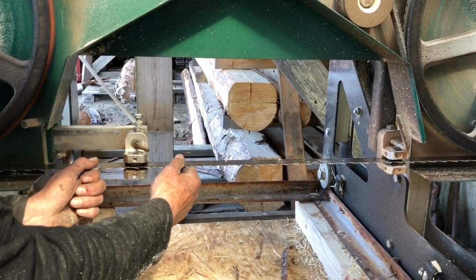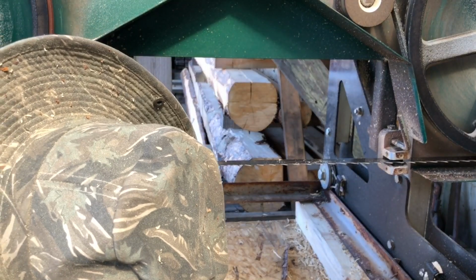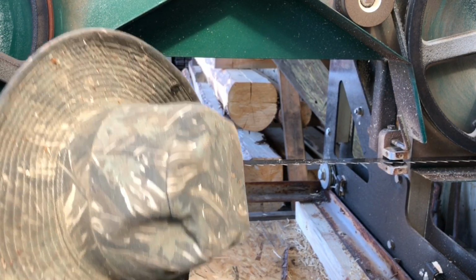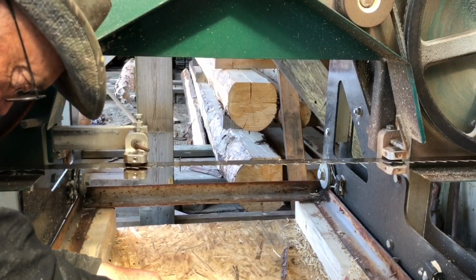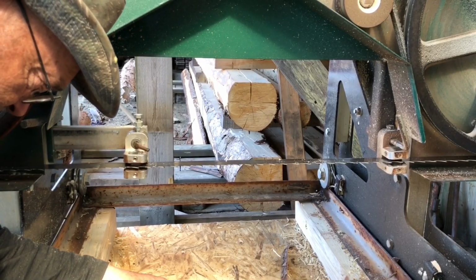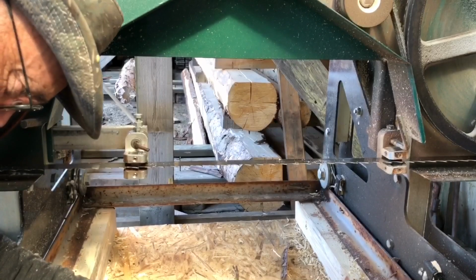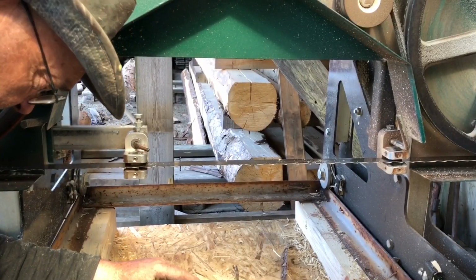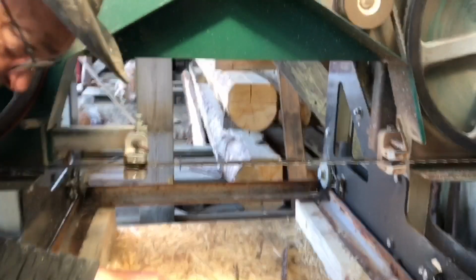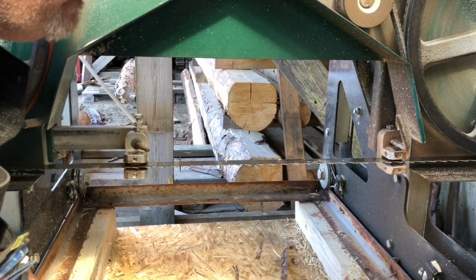Have we got any blade wobble? Considerably reduced. Look at that. Well, that's going to stop the wave. That will. That's much better. Okay. New bearings. We'll turn the blocks around. Right, so we reverse use them. So in another 3 years, 4 years, we can put the replacement blocks in. There. We're all good. Done.